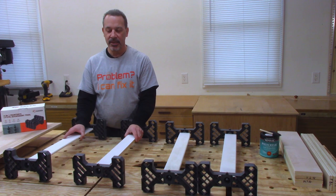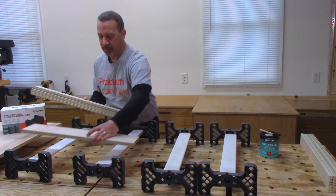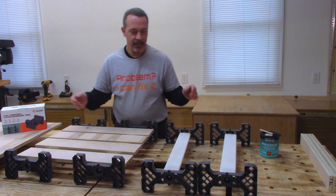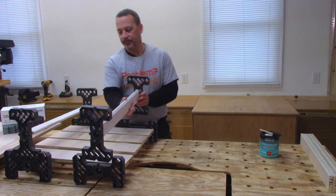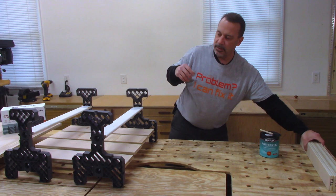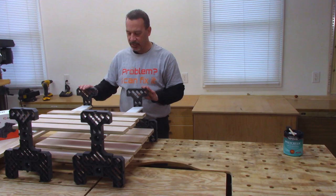Put one on the other end and it gives you a little platform. Once you take your scrap wood and screw it between the I-beams, take the pieces that you need to paint or finish and just set them across like this — it's nice and stable, you don't have to worry about them falling over. This is where the stacking ability comes in: you take the next set and set them on top like this, then you can put more boards on top. This works pretty well — I can polyurethane my pieces, stack them up, use less space in my shop, and it's easy to adjust for longer boards.